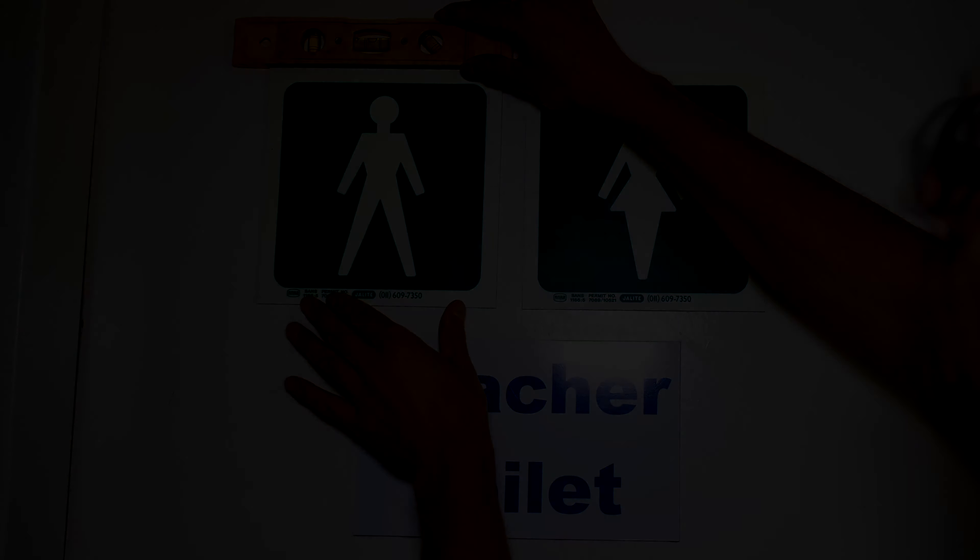Here is the toilet door — I'm going to put the first sign there. Because of the press stick I know exactly where to position it and it holds in place. I can see where the putty is and place the sign precisely. I then level it and depress the putty. Make sure you don't get any silicone on the signs. The beauty of the putty and silicone combination is that it still allows you to adjust the sign to get the correct level.